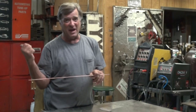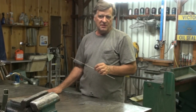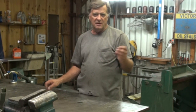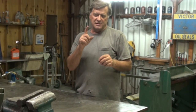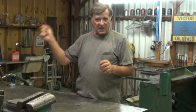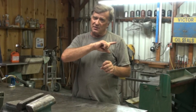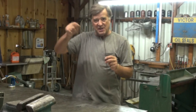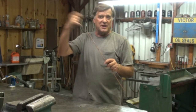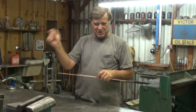Something to keep in mind when you're changing wire sizes — whether it's filler rod or a spool of wire in your MIG welder — don't forget to change your tip size in your MIG gun for the different size wires you're using. You might even change the tungsten in your TIG welder: a 1/16th for the 1/16th wire, and 1/8-inch for the 1/8-inch wire. Because you're going to be changing your amperages or voltage to put enough power on there to help melt that bigger wire. Make sure your machine is set up correctly to go with the different thicknesses of wire you're going to be using.